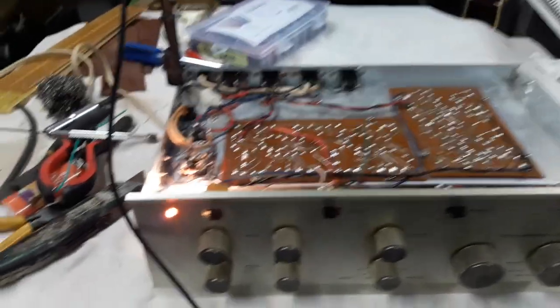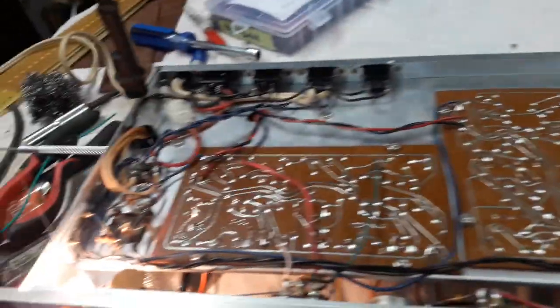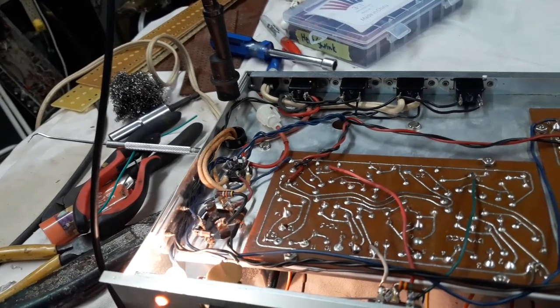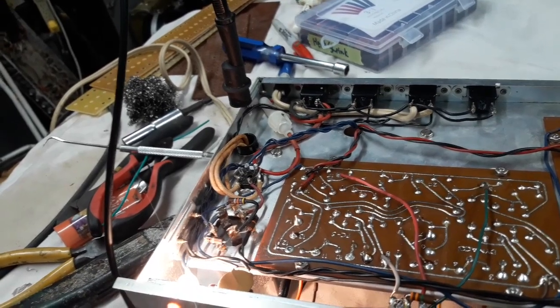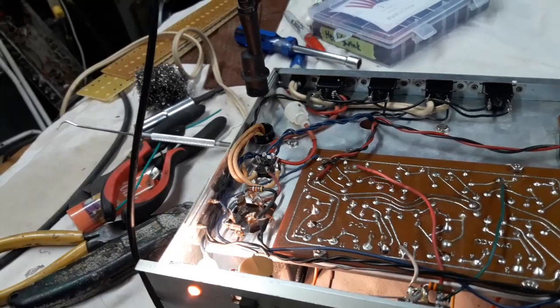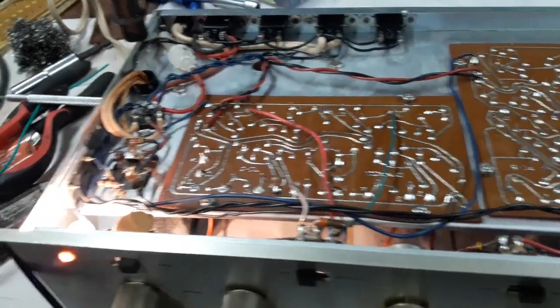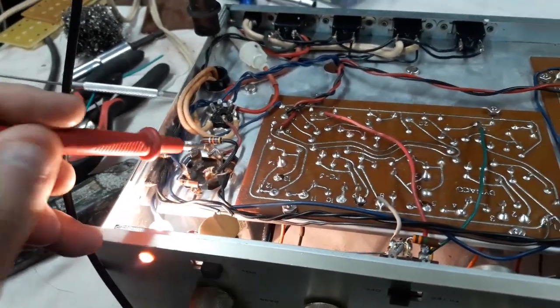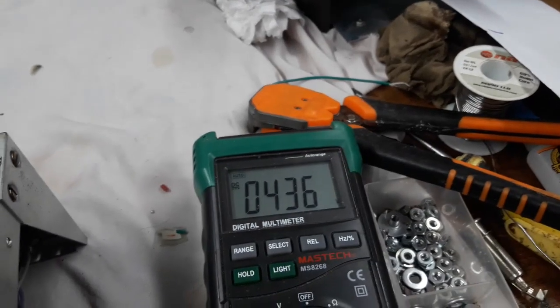Okay, flipped over and switched on. Ground clamp in place, and I'm just going to wait a little bit for that tube rectifier to heat up to full conduction. And again, the highest one was supposed to be around 405, and the lowest one was supposed to be 210, if I remember correctly. Imagine I'm working on this thing off of memory, not even using the schematic. Right, so this one should be up. It's a little high now. It's gone up to 436.